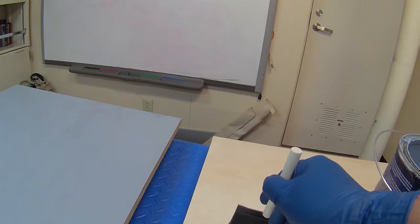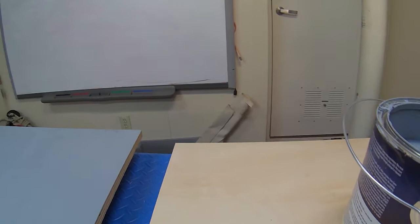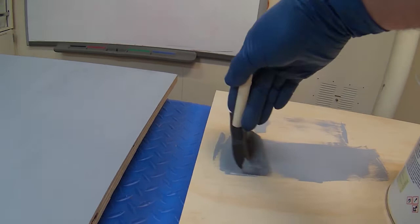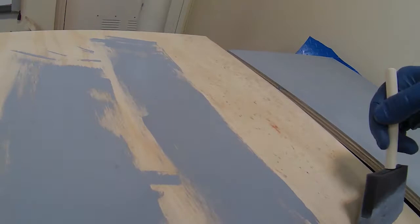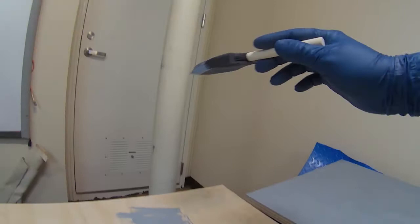I'll start in the middle of my stroke and go back and forth. This way you don't have a big glob of paint right where you start or finish — it's hidden away in the middle and evenly dispersed as you continue. When I go back and forth, I keep hitting that middle area, distributing the paint. It's much, much neater. When you lift up, it's like an airplane taking off — you don't just stop and bring up because it leaves a mark. Take off gently, not with a big flick or you'll splatter paint, just nice and gradually.